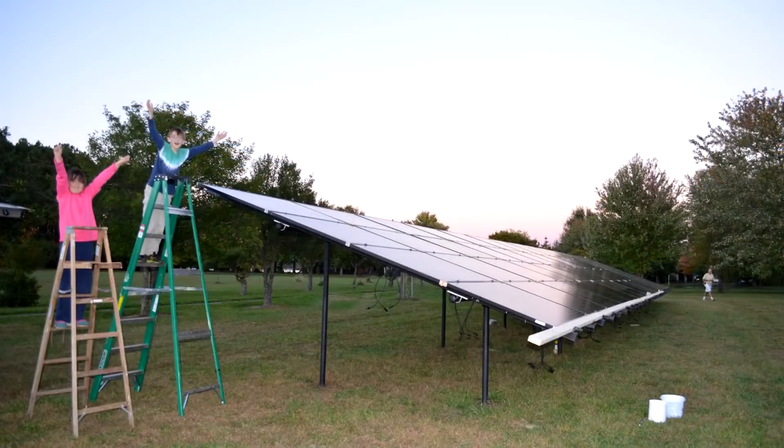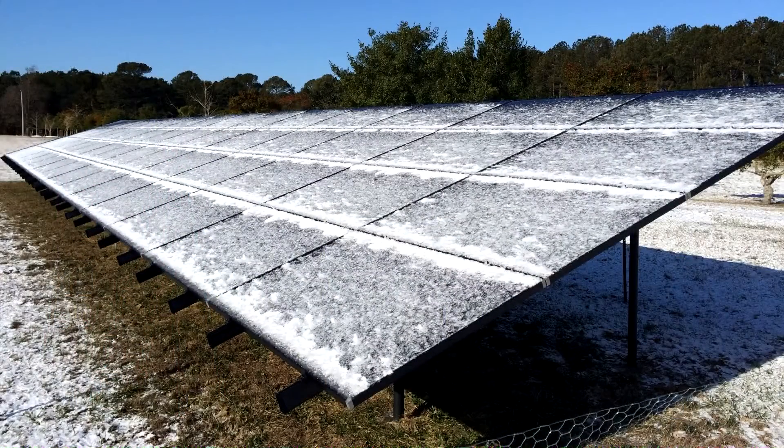At the same time, an inclination of 19 degrees provides more than enough slope to allow the washing away of dust and pollen from the solar panel surfaces when it rains.